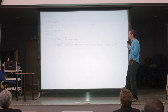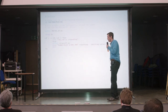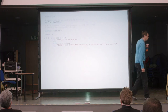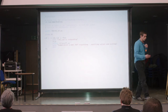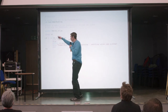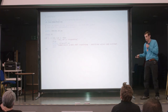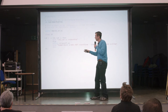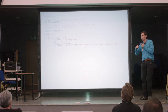This is run as a cron job. The first thing you need to do is actually change into your working directory. The thermostats themselves, if you leave them running all day, they break — so what I've done is I turn them on, wait 15 seconds for them all to settle and poll, use them, and then turn them off. Then they don't break, which is always a plus. The other important safety concern: once you've turned them all on and waited 15 seconds, you've got to check that they actually work — because if you don't, the entire house turns on for hours. So if I haven't got any output from room one radiator, this circuit turns off every radiator in the house. The fail-safe is that if it doesn't work, everything goes off — I'd rather have a cold house than an expensive hot house.